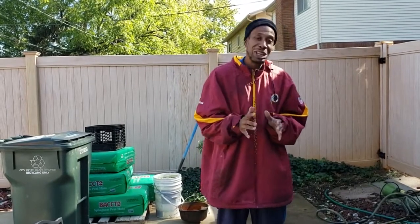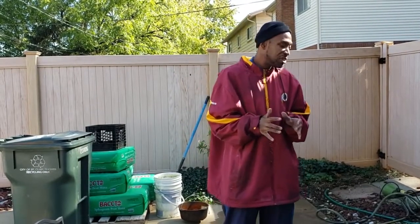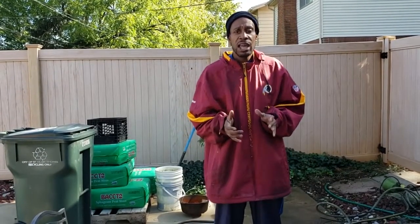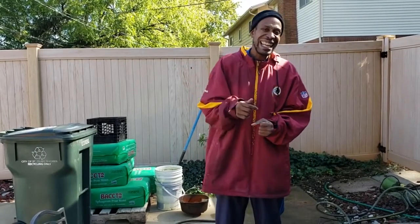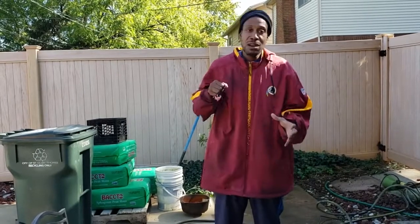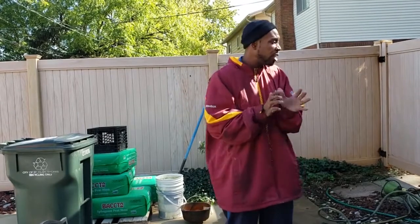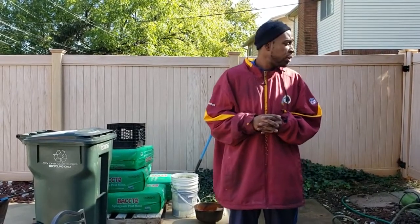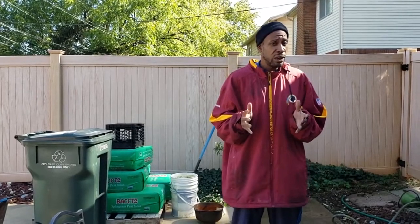I like to do something a little extra. I like to blow the air out, make sure that the line is open, and make sure I've got bubbles coming through. Then I like to try and hose in at least a gallon of antifreeze into that line, and then blow my antifreeze through with the bubbles, seeing air and antifreeze come up, sealing off the line. Therefore, if at any point in the wintertime something might happen, I have peace of mind that I tried to get the antifreeze in. So those are the steps that I use. If you follow what I do, you might end up like me.